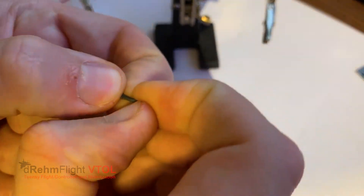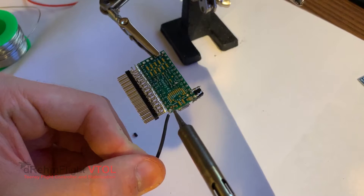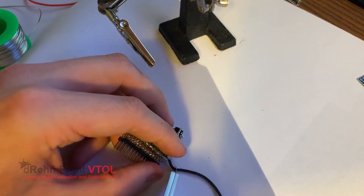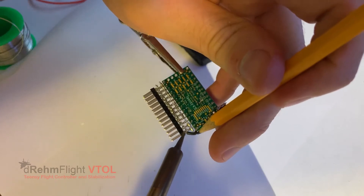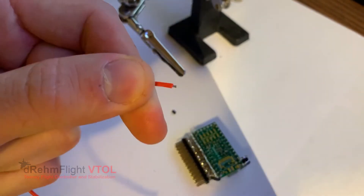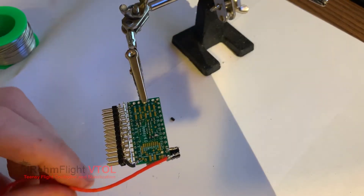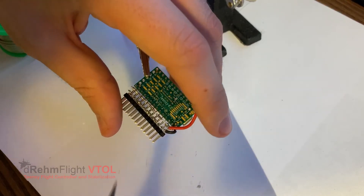Next, we're going to ground that outermost rail from the three-pin headers, taking about 20-22 gauge silicone wire, stripping it, tinning it, and we're going to solder that to the ground pin on the corner of the Teensy. Once we have a good connection, we can cut it to length so it wraps around to that outermost rail of ground pins we soldered together earlier. Tin that, wrap it around — be very careful because it's a small piece and it's going to be really hot. Then we do the exact same for the power rail: grab some wire, strip it, tin it, solder it to the power line on the other side of the board, cut it to length, and solder that to the innermost line we soldered together earlier.